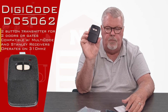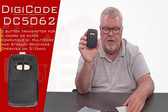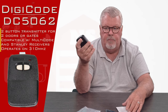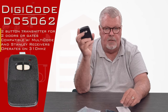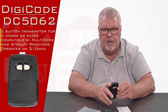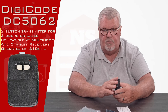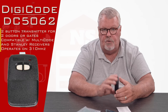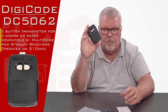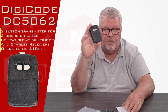When you're buying these, there's another version that is in gray, off-white, or a putty color. It looks the same and it's going to have a different part number written on the back, but it's a 300 megahertz. In the DigiCode family they make the same line of transmitters in two different frequencies — 300 and 310. Make sure you don't buy the black one just because you like it if you already have the white one, because they're not interchangeable. That's something you need to look at before you make your buying decision.